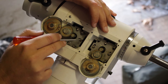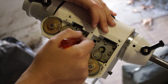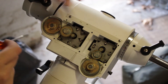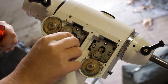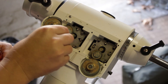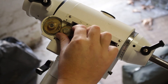The stepper motor is fastened by these three screws here — you'll see they don't have an Allen key or washer around. So you do the same process: just slightly nudge it at the bottom while it's loose, feel that everything is nice and tight, and then just tighten them up. Not too tight — you don't want to strip anything on your stepper motors or any of these gears.